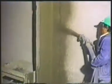The quality of the mortar is obtained through a good distribution of the sand granulometric curve, with the possibility to use an aggregate size from 0 to 8 mm, forming a homogeneous mix of high quality. By mixing in a mortar mixer with an exact dosage that is uniform in the times, you will obtain the required resistance during your whole plaster job.